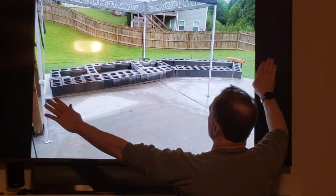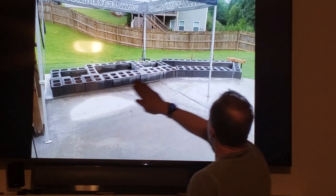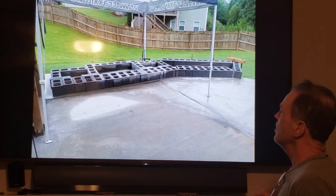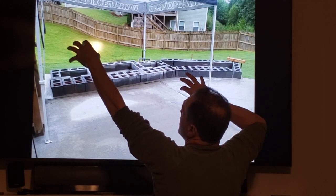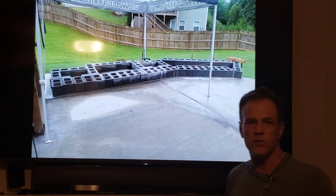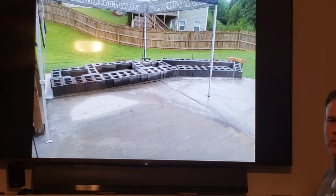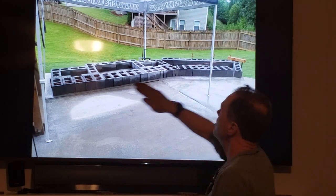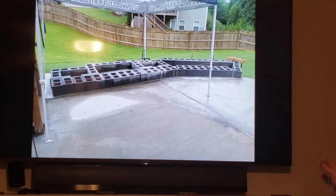Anything you're gonna do on a project of this scope, no matter how your mind or brain works, you have to build it literally one complete level at a time in order to ensure that it maintains level, okay? So you'll see later, mine gets a little askew because I built one firebox up completely. And then I tried to build the other firebox and they didn't match side to side. Now, no one on earth knows that but me, and now everyone on YouTube because I told you that. No one on earth could see that, but I'm a perfectionist. I wanted my project to be perfect and look spectacular. And so that's how I wanted to do it. Well, my new experience dictates to me that you would literally never proceed without every course on that next level being done, okay? So, don't do what I did.